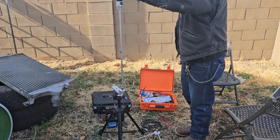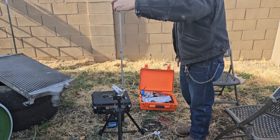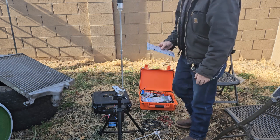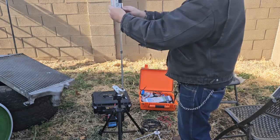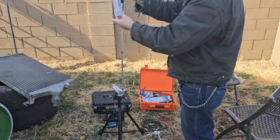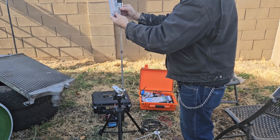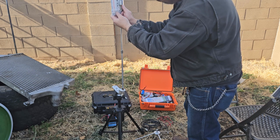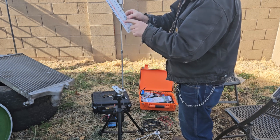The adjustment on this coil covers 10 through 40. These are the standard whips. And the reason I like this better than the Wolf River kit is because the Wolf River kit is decent, but it's really kind of more do-it-yourself. When we have this ruler here, it gives us a length for - with the 80 meter coil - where we're going to be at on the band, or the 60 meter coil, or just the 40 through 10. This is almost spot on if you put the radials on like they recommend.